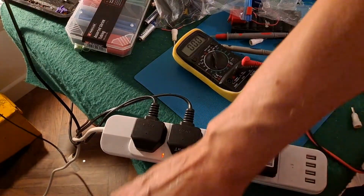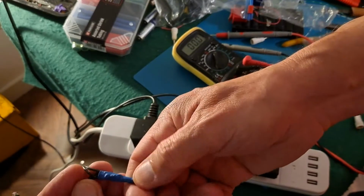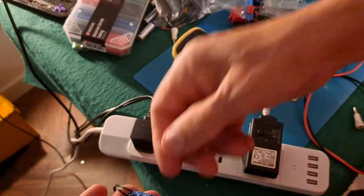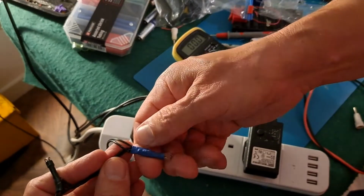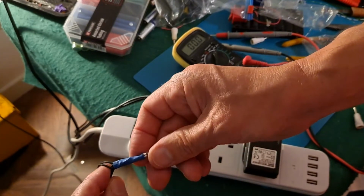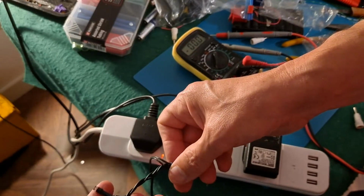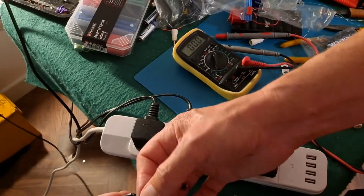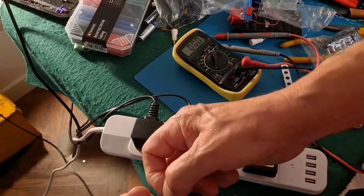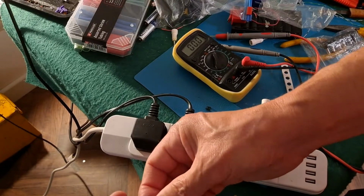And it might be, if you remember at the beginning of the video, we were looking at this one, which had got a couple of odd wires which weren't terminated. They were terminated to each other, but they weren't terminated to either leg of that LED. And if I do terminate them to one leg of that LED, we get the flashing, but we still don't get the right colours coming on. Because I haven't stripped that one right back to check what's going on. Well, no, it must be right, because we've proved we've got all the LEDs light up.